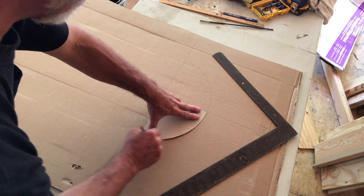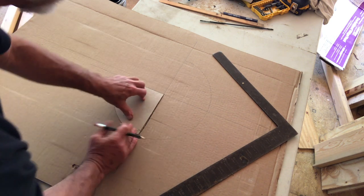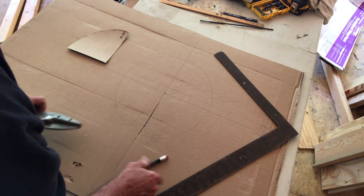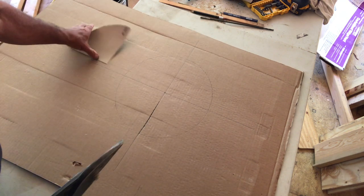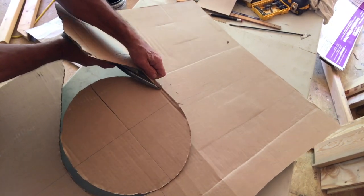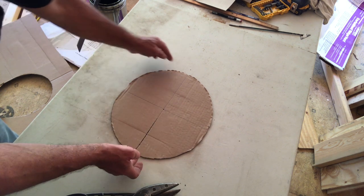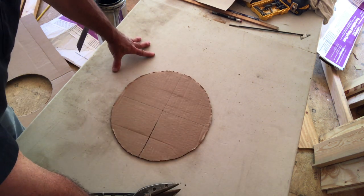The four quarters. Now if this pipe were in a steeper pitched roof, this would be longer. I once put a three and a half inch pipe through a 16-12 pitch roof and it had to be finished perfectly on the inside — nothing to cover it up — and I did it with this same technique. Now I'm going to cut this out. There it is — the ellipse for 12 inches going through a 6-12 pitch. I'll put that on the roof, trace it, cut out the plywood, and mission accomplished.